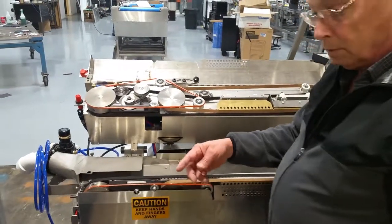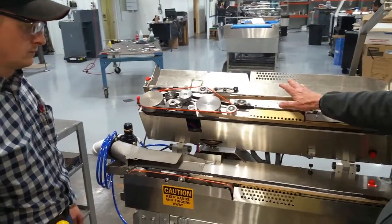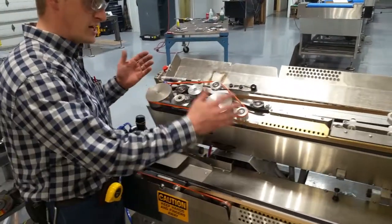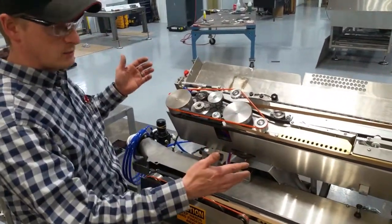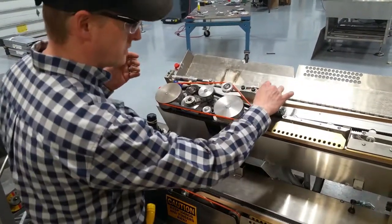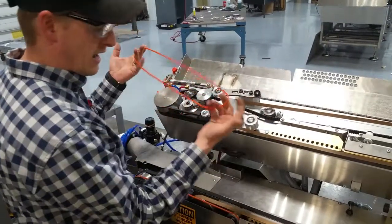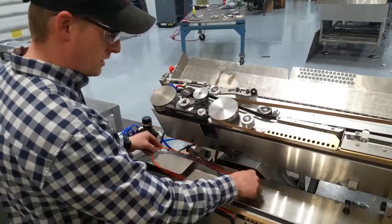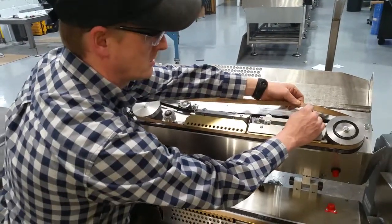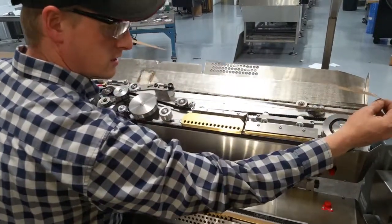All right, y'all remember Jimmy from a video past? That's my son. He's gonna show you how to change the belts here and the blade. So changing the belts can be done at the machine. It's a tool-less change. So the orange Eagle belting, you just got a quick tensioner here. It comes off. You have to take it off to change out the Teflon belt. So obviously once that's off, you're just gonna slip past your idler. The belt comes off easy.